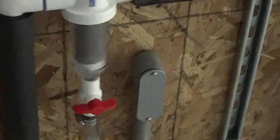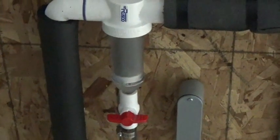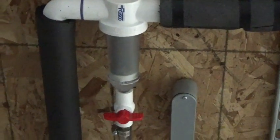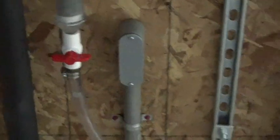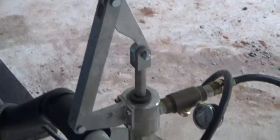We put heat tape on the water box of that pump, and all the water lines that are exposed have heat tape on them — good for minus 40 degrees Fahrenheit to keep the water flowing. Also put in a Rusco spin-down centrifugal water filter. Didn't want replaceable filters; this one is a sustainable, rinseable, back-flushable filter.